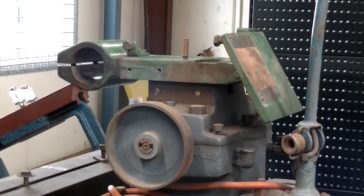Looking at it from the other side, yes — I think that the spindle housing from the front will have to be cut off that mount plate, as it'll just get in the way of grinding on the machine. But at least with this setup I'll be able to power the Cincinnati Number 2 from up on top here. I'll have to look through all the accessories I have to see if I've got any arbor extensions so I can get the grinding wheel out closer over the top of the table. I can see why these are still quite so popular — they're a pretty universal machine, although they do have a very big footprint and take up quite a bit of your workshop real estate.